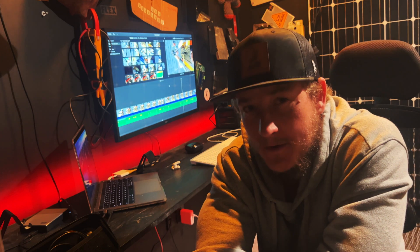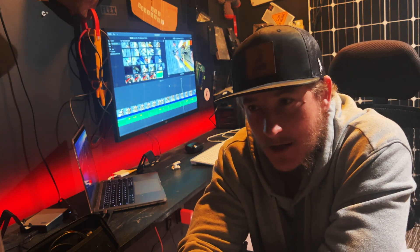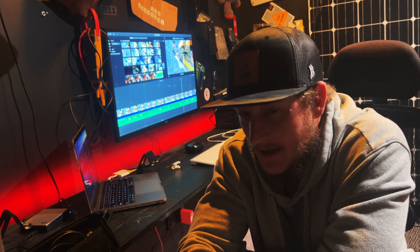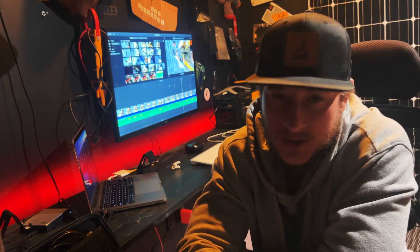Just finishing up the editing — I want to put out two caveats. First, make sure your roof doesn't leak. I showed a flashing in the video that I didn't end up using, but use flashings on your installation. Put some nice sealant underneath them and make sure it goes up and under the shingle line.